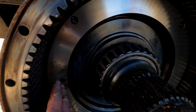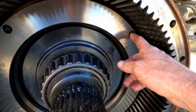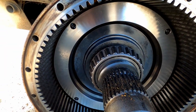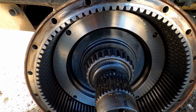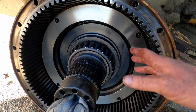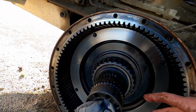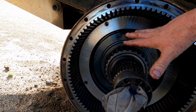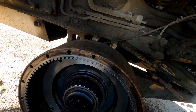That sits right here against the piston. If we were going to rebuild the piston, there are keepers on the back that hold it in, and it's got two high-pressure seals — like you'd see in a transmission on a piston, maybe nylon or whatever. But we don't have a problem with that so we're not going to worry about it. We're just going to get the bearing off, get all this cleaned up inside, and go back together.